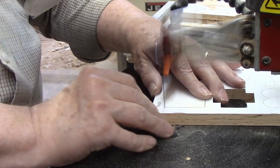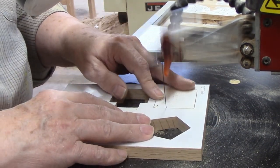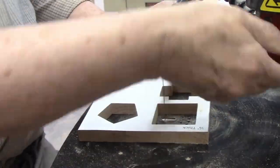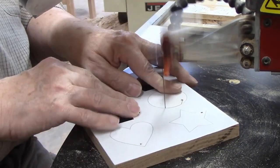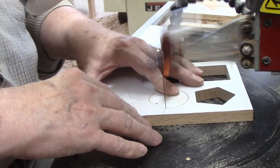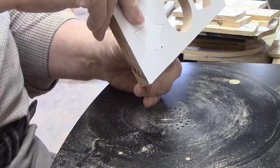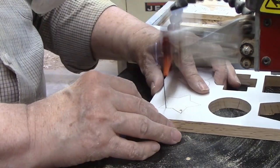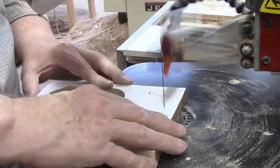For a beginner, the 90-degree angles are likely the most difficult to learn to get nice, crisp corners. The square and the cross will give you some practice on these. My method is to cut down a line until I get to a corner, then stop the blade right at the point of the intersection. I then back off the blade very slightly and use the saw kerf just created as a space to pivot the workpiece to the new direction I want to cut. Then I start pushing the wood into the blade once again. With a little practice, you'll find you can get very sharp corners.